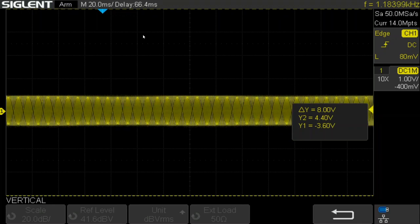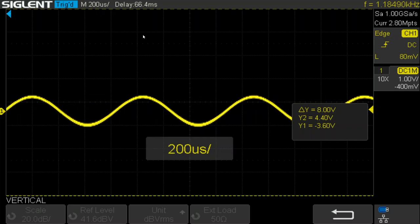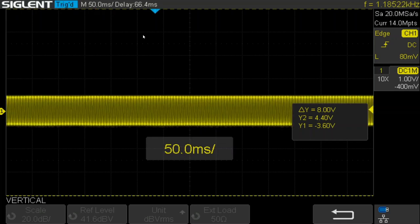And it doesn't recover as quickly. And in fact, I've noticed that if I get it low enough, I can get some instability in the output amplitude, like I've seen in other circuits. But above 0.5 volts RMS, it seems quite good. So, let's see, come out again so we can see that it's still the sine wave, go back in again, and look at the FFT.